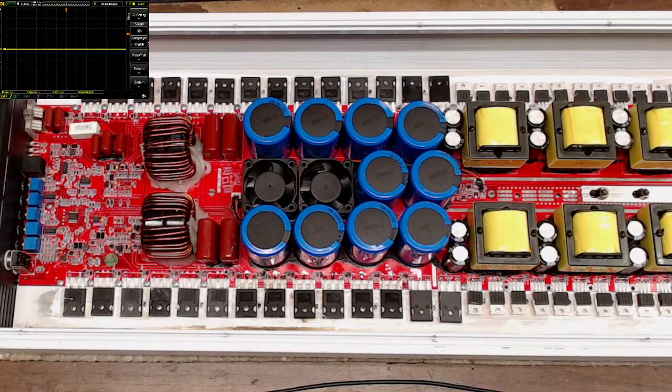But I find the numbers are a little closer when you test them to the 18502s. So in my opinion, if you have a good supply of 18502s, I'd use them or the 1404s. I think the 18502s might be a little easier to drive than the 1404s, just based on some of the failures I've seen between these Brazilian style boards.